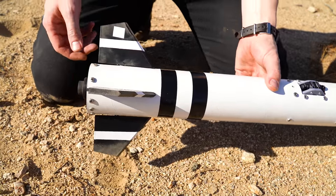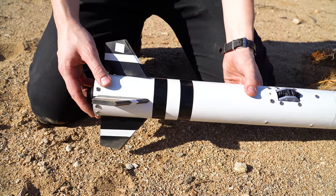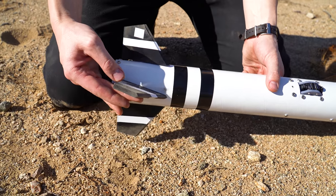These are all loose — this is the only one that isn't. There's an arm that connects the shaft to the servo rod. I worked very hard to get this to work with an epoxy bond, and it looks like three out of four bonds slipped. What ends up happening is the fins — the actuation point is forward of the center of pressure — which means that when they fail they will fail straight. But when you have an angle of attack, the fin will match that AoA, so it's not providing any of that restoring force that makes your rocket stable with static fins. It'll behave as if it doesn't really have fins.